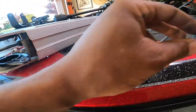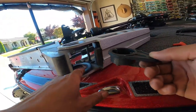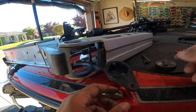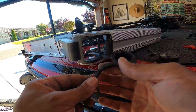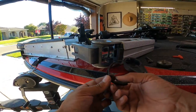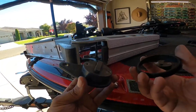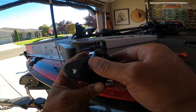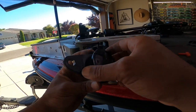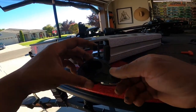Lift the other side out and the other side's completely gone — that was the piece that fell out. So yeah, these ones are well overdue. These bushings sit like this — you want that piece to be over the top, it's got the cutout for it just like that, and you'll want those oriented like that on both sides.